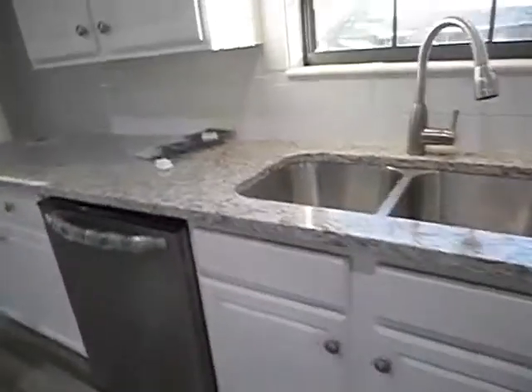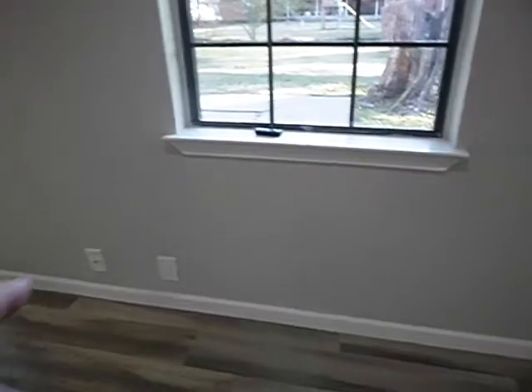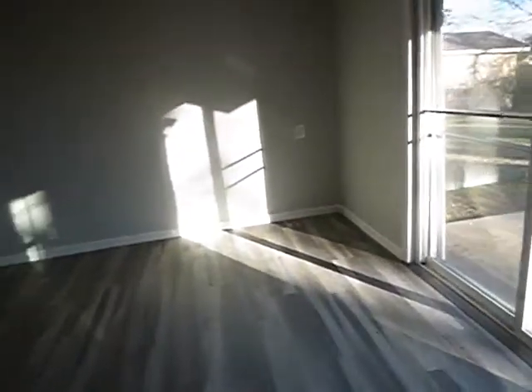We do not have an electric receptacle outlet on the east side of the cooktop, and we don't have one on the west side of the kitchen sink. This window is the only broken one — it's a double pane, aluminum frame, and the bottom pane is broken. I've opened and closed all the windows and checked all the outlets. We don't have any grounding in the kitchen, no GFCI, and no grounding or GFCI in the laundry either.